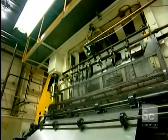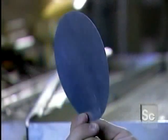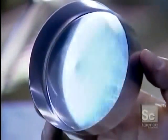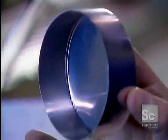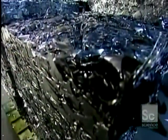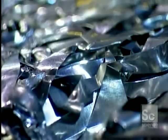The sheet feeds into a press that punches out round pieces that'll be formed into cans. The punch press actually performs two operations: it punches a disc five and a half inches in diameter, then bends it into a cup. What's left of the sheet gets compacted and sent back to the aluminum factory, where it's recycled into new rolls.